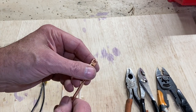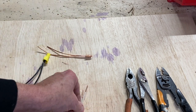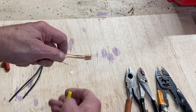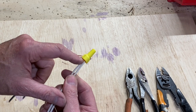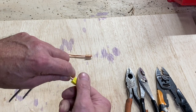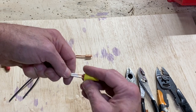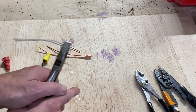You can use a copper compression fitting, which is approved. If you have two 12 gauge conductors, don't use the wrong wire nut — a large wire nut is too large. Use the appropriate wire nut for the number of conductors and gauge. Most people strip the wire and just twist the wire nut on, but two problems: the wire is trimmed back too far, exposing copper — keep the insulation inside the wire nut cap. Also, you really need to pre-twist these to make a good bond, then apply the wire nut.